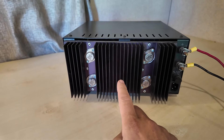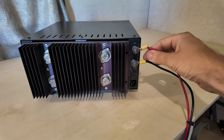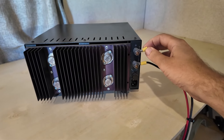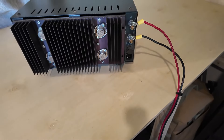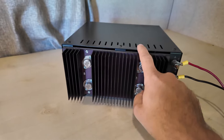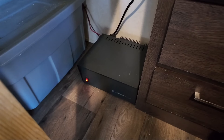On the back of this big beast of a power supply, you have some output power regulators and a massive heat sink, then a fuse, two terminals, and a place for shore power to plug into. These two terminals are only going to power so many things before you fill up those lugs and make things really ugly. So one of the things hams like to do is put power poles on everything. I have a power lead here with some power poles on it, and now the power supply has been banished to the floor to never be a problem on my desk ever again.